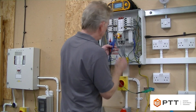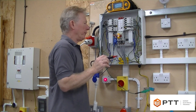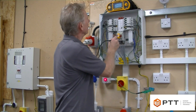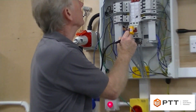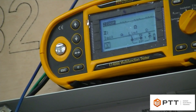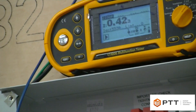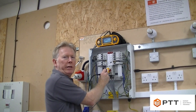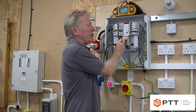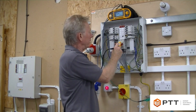I'll croc onto the earth that I've removed, then croc onto the neutral. On three-phase we do three readings and take the highest. I have to wait for the meter to give me the go-ahead — that tells me when I've got good connection and voltage — then I push the button. I've got a reading of 0.42, which is a little too high for a TNCS or PME reading, which should be 0.35. However, I know that in this building we are reading the wiring in the building as well, so I can accept it in this particular case.